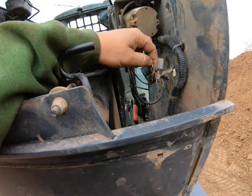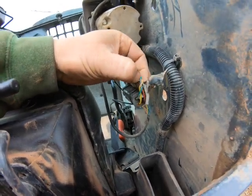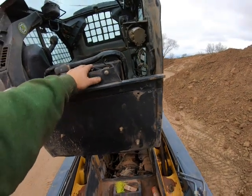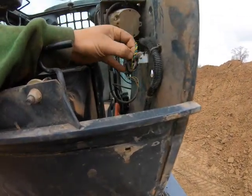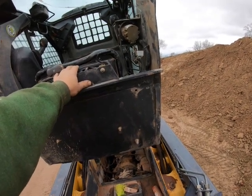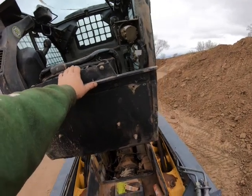The next step is to drop the cab, pull this wire away from there and make sure it's not touching anything. I really need to separate these wires better and make sure the green wire insulation is okay. I'm going to pull this away and get in the cab and see if I can get the machine to work. I don't think the wire is broken all the way through internally — there might still be continuity — but either way, that wire needs to be fixed.